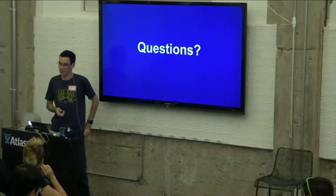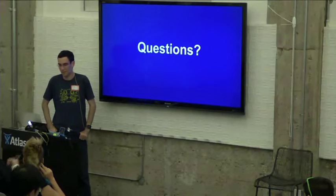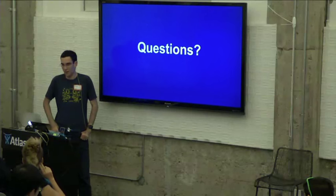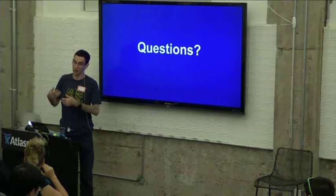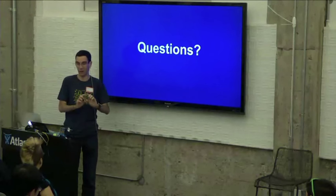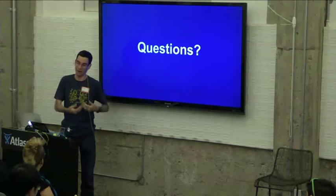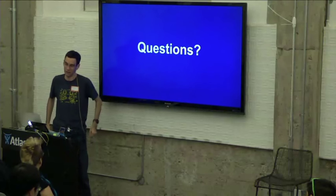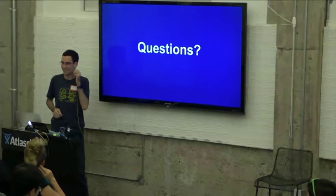So a good application that uses this would check to see if that was received and verify. Yeah. With the generic service, we have these ACKs. So you actually get a callback if it was a write request. We have a did write callback that you'll get when we get that ACK back, and that way you know that it was actually successful. Cool. I think I'm out of time. Thanks.